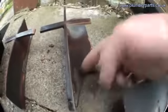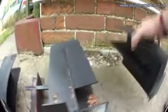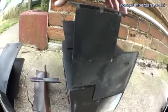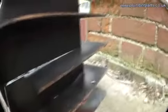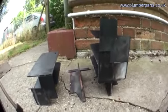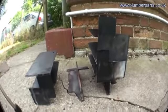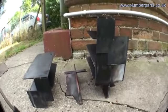So firstly the hot gases come up through here, round here, up through this small hole here, like so, goes round this part here, up there, and is again forced round another area, round here, round the back here, up here, round here, and then finally out the front, where it then goes up to the condensing chamber. You have 2 columns like this, so straight away, without there even being a condensing part, the actual standard primary heat exchanger is already miles more efficient because it keeps the heat in there for as long as possible to allow the water a chance to collect heat from that and take it off to the radiators.